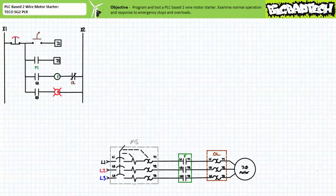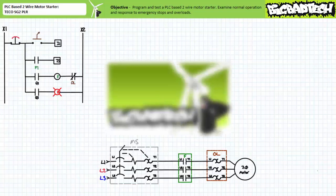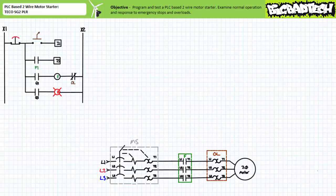Here's the paired-down schematic representing only those field input and output devices and primary elements we'll be making use of today. As you will no doubt recall, a two-wire control circuit as implemented using traditional hardwired relay-based ladder logic is one that does not maintain or remember the last asserted state because it does not feature a holding circuit. Two-wire control circuits commonly make use of automatic inputs like pressure, float, temperature, or limit switches, and are employed in applications where the unexpected startup of the system does not have the possibility of injuring an operator. If you need review of two and three-wire control circuits, you are encouraged to revisit that lecture available at the Big Bad Tech channel. For the purposes of this exercise, we're going to use the normally open maintain contact selector switch on input 1 as our simulated automatic input.